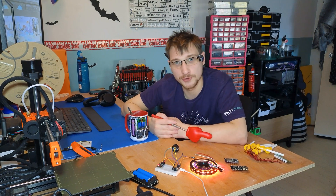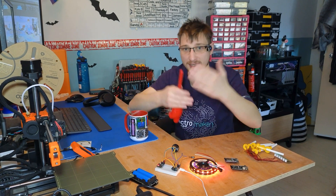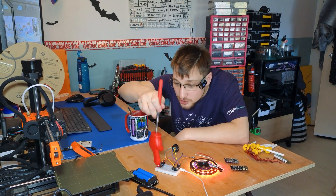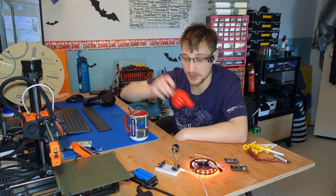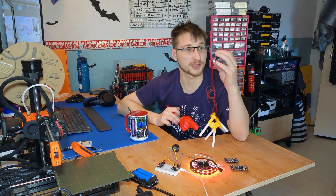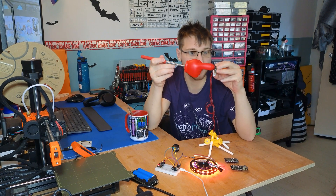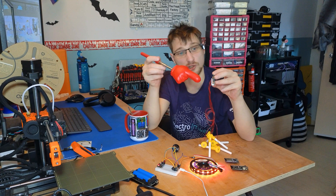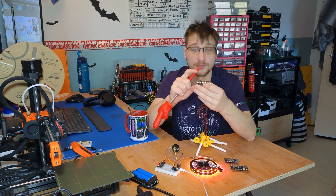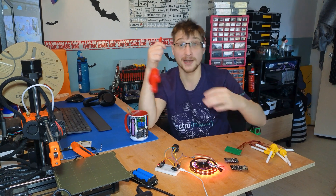I've really wanted to use this millimeter wave sensor, just because it's a cool sensor and it can do a lot — it can work through plastic, through pumpkin and whatever. But I'm going to have to pivot and use something else because this guy just does not want to do what I want it to do. Another thing I need to figure out is how to interface with the humidifier buttons. Best case scenario I'm just going to hook up a GPIO pin to it and send it a pulse. Worst case scenario I attach a servo that presses the button. So that's where I'm at mentally and physically — I'm going to go back to work.